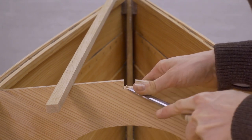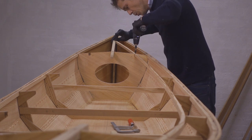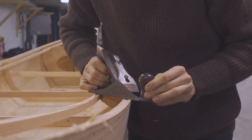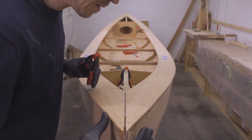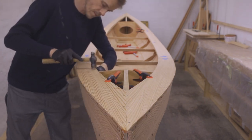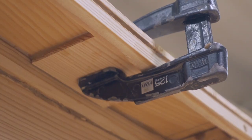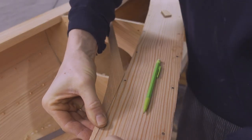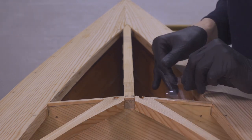Now I'm ready to start building the deck framing. First I'm installing the center carlins at each end of the boat. Then I'm installing the long carlins that run parallel with the shear plank. When they're in, I'm fairing the deck structure. I want an even surface with smooth flowing lines that will fit the decking nicely. The decking consists of two layers. The lower layer are long narrow covering boards that go all the way from end to end. The covering boards are fastened to the boat with thickened epoxy and bronze ring nails. A thin block of wood is glued under the covering boards where they butt together. Then the upper layer of decking goes on, supported by the covering boards, the center carlin, and by the knees I'm installing here. To get the watertight bulkhead and the center carlin at the correct height to support the decking, I'm gluing in some thin strips of wood.